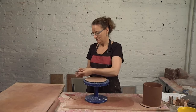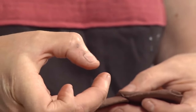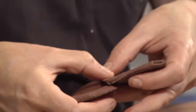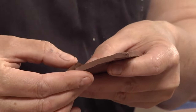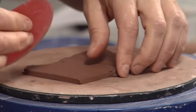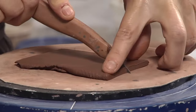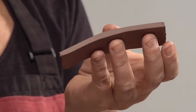They're overlapped, and my action isn't just to press straight down — I'm pressing the lower part away and the upper part towards me, really trying to compress and spread out the particles so I wind up with one continuous slab. Once we finish, we're going to cut it apart so you can see it's actually pretty close to the same thickness as the rest of the slab. You can see it has a little bit of thickness but it's really close to the rest of the wall — and that's what you want.